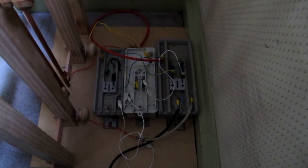So at the moment I'm doing a low power test, which is three 15,000 volt neon sign transformers. Added together they're about 110 milliamps they'll supply. Yeah, let's give it a go.